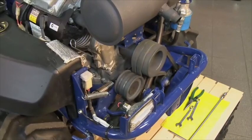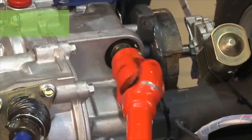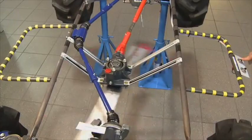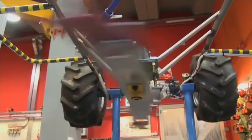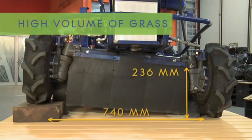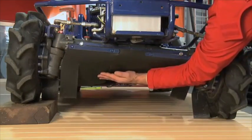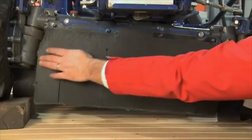The system is simple and easily serviced and maintained. All engineering in the shaft system is extremely heavy duty, with large diameter shafts with solid splines, helical gears, and large bearings with multiple seals used throughout. The front of the mower deck is a large rubber flap that is capable of processing high volumes of material from grasses to 38mm saplings. As the material flows beneath the front axle, it is angled into the blades with a bean cutter style cutting action.